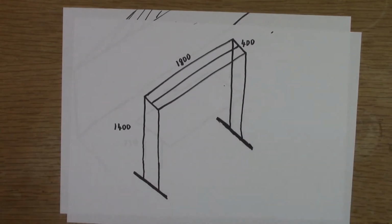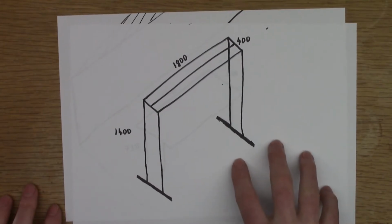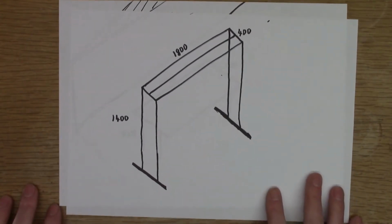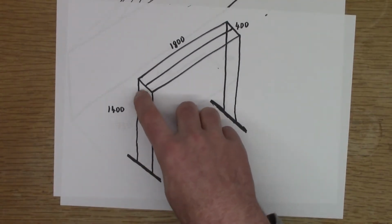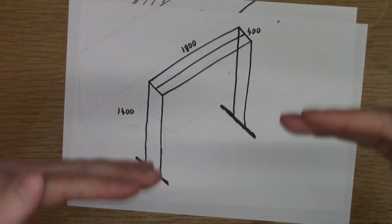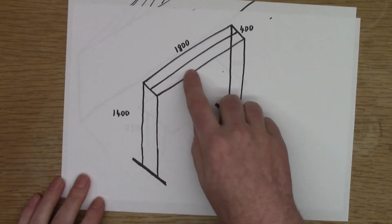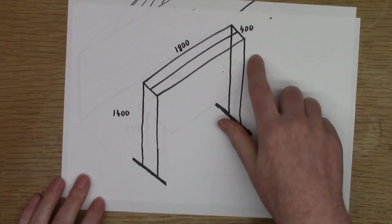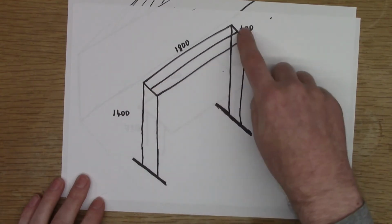This would be a floor standing frame, so that if I touch the table, that vibration isn't transferred into the camera. It'll be approximately 1400 millimeters high. That's just enough to touch the roof without having the table be too far away from the back wall. And 1800 millimeters wide, and I would probably use steel bars to make this frame.